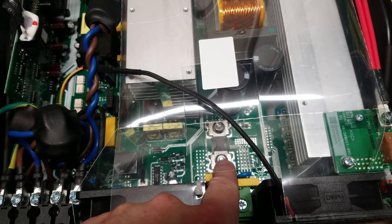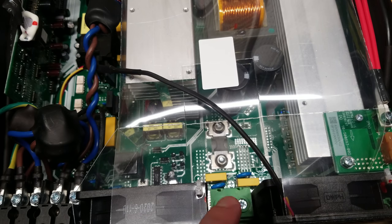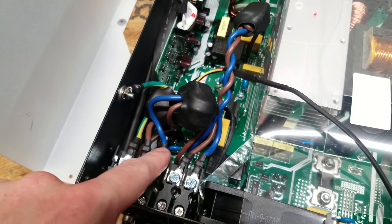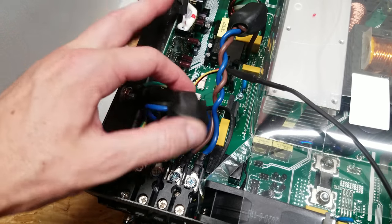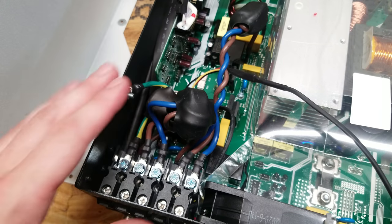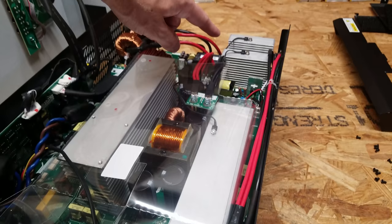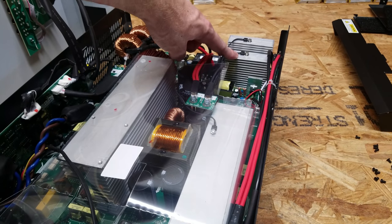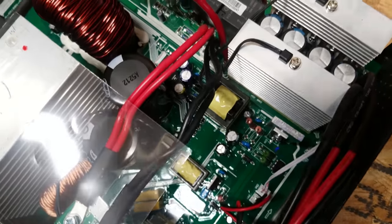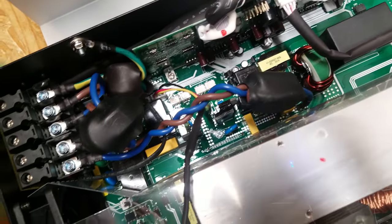This is a 58-volt, 200-amp fuse. And it is bolt-on so you can replace it, though that's not a standard fuse size from what I can tell - maybe you guys know what that is. On the left here, both the input and output are 12-gauge conductors. This is rated for a maximum of 40 amps input and output, so I would have liked to see something a little thicker than number 12. But number 12 is certainly acceptable for chassis wire ratings since this is inside an enclosure. In the front here, there are two 40-amp fuses which go all the way to the back - I believe this is the MPPT charge controller back here, so these fuses are probably for the built-in charge controller. All in all, looking at the wiring, the connections, the solder joints, it looks fairly decent quality. I have no complaints about the internals of this unit. I don't see anything that's done messy or unclean or potentially dangerous.